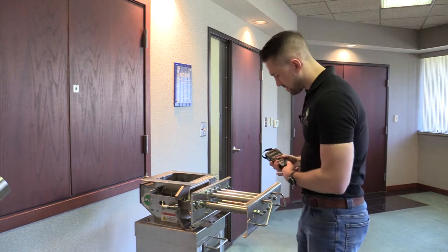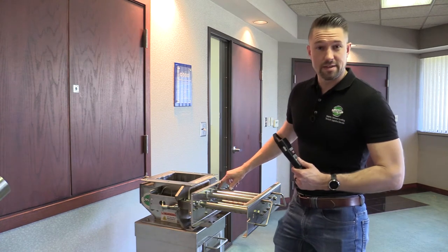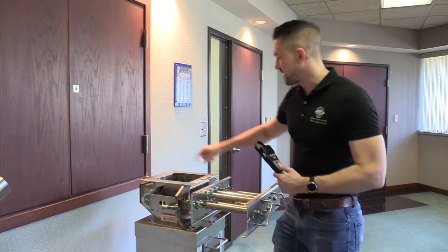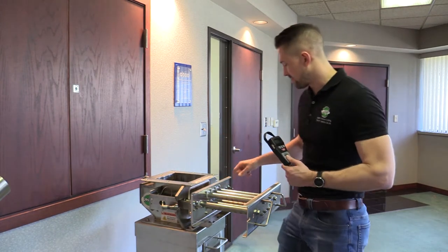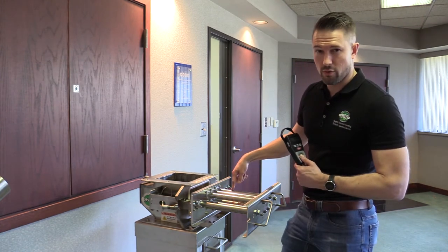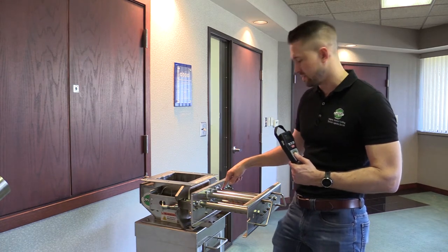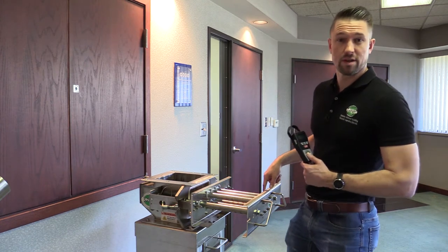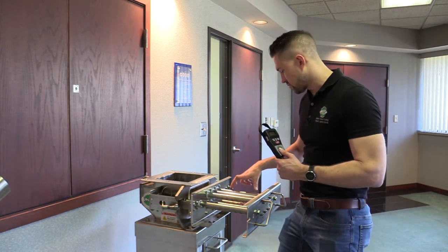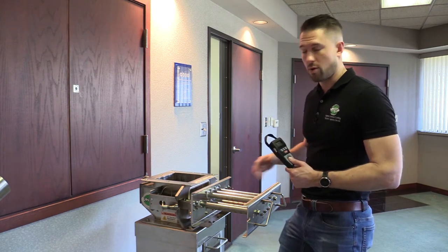To start my test, I'm going to test on the inner pulls only. There's dead space at the end of these tubes, so there should be no magnetism here while we're running production — that's held outside of the product flow in the back. The first pull piece, just before the product flow area, has a lower pull value because we're slowly removing the magnetism to drop off the metal at the end. We'll test right here in the middle, which is where the product flows through — that's the best representation of where we want to do our testing.